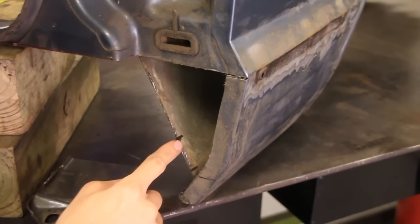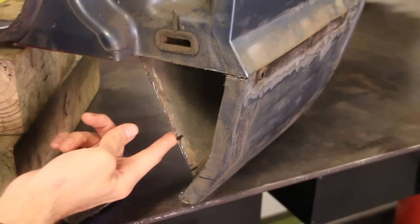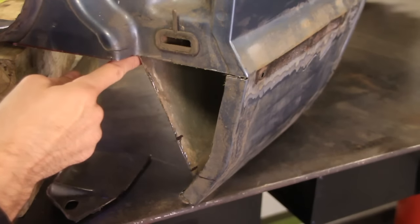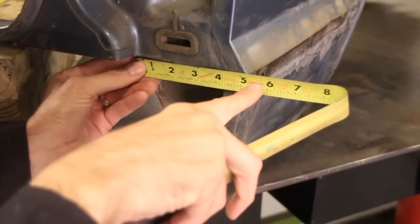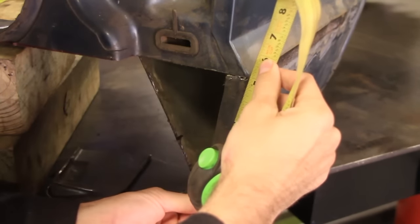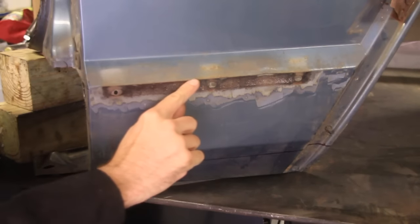Mark four inches on this side, four inches on the other side, and then cut a line. I've already marked a line straight across at four inches over here. On the other side it's a little farther out — between five or six inches — just enough that this will come all the way up and meet right here. So that one is five inches. We want the right side to be five inches long so that it covers up this hole. I've marked five inches down from where we're going to bend, made a line right here, and marked that line all the way across.